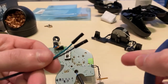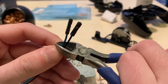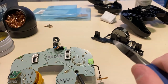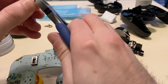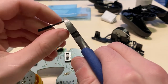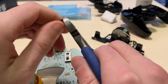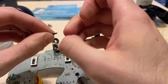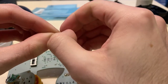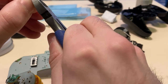Take your jumper cables and split them in two, making sure you have two female ends with about an inch or two of wire to work with — we'll be inserting our ceramic capacitor into these. Once they're cut, we'll need to expose a bit of the ends of the wires for later soldering. If you have wire strippers, you can use those to make stripping the wire casing off easier. But since mine were confiscated by the TSA, I had to use my wire cutters to carefully wear down enough casing to pull it off with my fingernails.